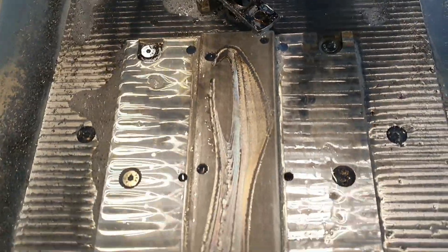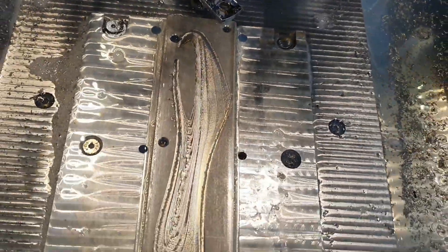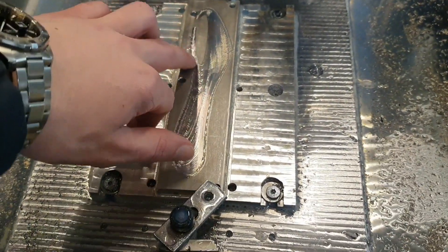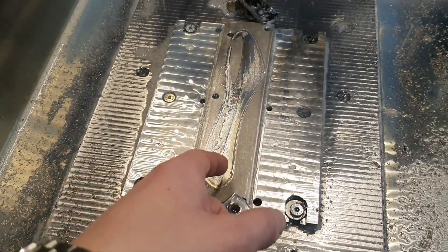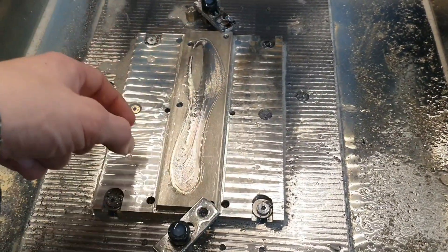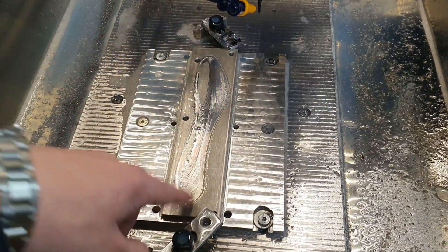This is how the 3D adaptive looks — got some stock to leave, so now we'll have to use a ball nose cutter to get a nice smooth finish. One thing I noticed was that on the other side I milled the contour first, and that was actually very good, since without doing that the end mill was smashing into a corner every time, which didn't sound too pleasant.